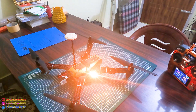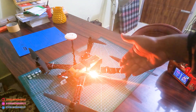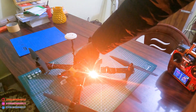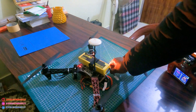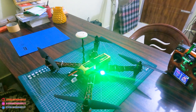Now you need to do GPS calibration. For that, you need to rotate the drone 360 degrees. This is the front direction. After rotating 360 degrees the light will be green. Then again rotate it 360 degrees but this time nose-down.